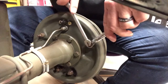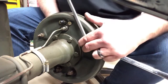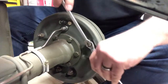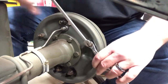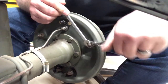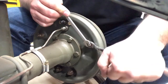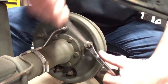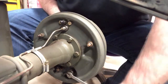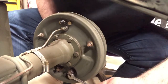The eccentrics are kind of old — one thing I didn't do is replace these eccentrics, so make sure you still have some adjustment left in them. That's a little tight, back that off a notch. All right, I'm going to do the same thing down here. That locked the bottom — loosen it just a hair until it's free.